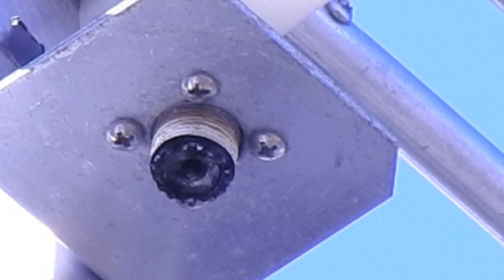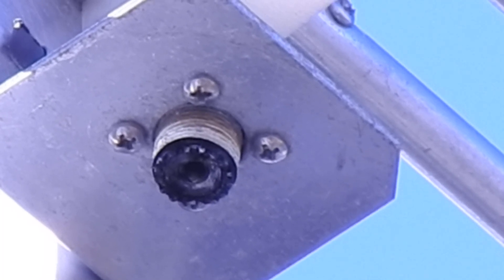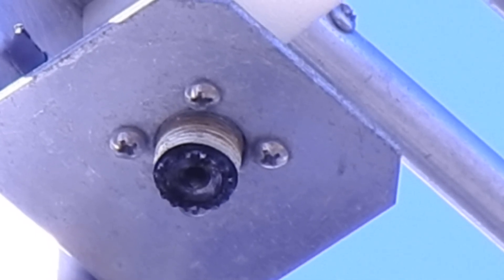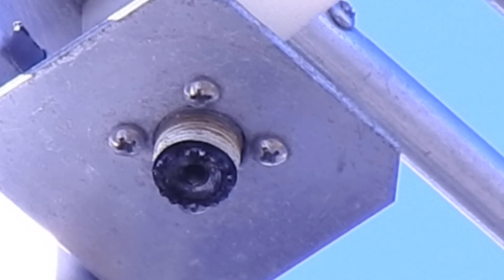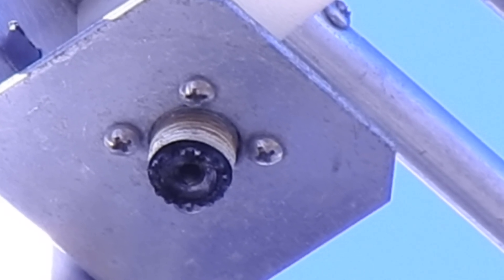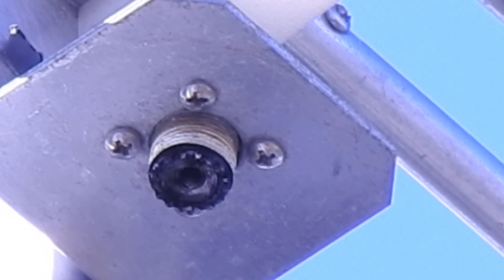Take a good look at the bottom end of this Shockwave antenna — it looks to be charred. I can show you the LMR-600 and a PL-259; it's charred as well. This antenna is sitting on top of an 80-foot mast with 97 feet of LMR-600. I was running a 12-pill to this antenna, and my SWRs are flat and my impedance is at 50 ohms. I have an MFJ-259B, an MFJ-209, and an SWR meter just to verify those readings.